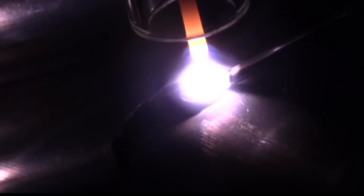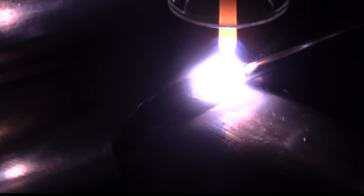I'm trying to keep the hot tip of that rod shielded with the shielding gas, but sometimes I'm coming a little farther out of the cup than I thought. There's a lot of forgiveness on aluminum because the metal solidifies and cools off so quickly — it's not molten for very long, unlike stainless steel or nickel where that hot tip of the rod can really get an oxide film on it. You can still add scum and oxide to the puddle if you come out of that argon too much, but you've got a little more forgiveness with aluminum.